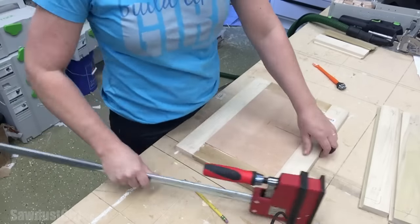I went ahead and started with 80 grit, went up to 120, and ended with 220. I finished up with 220 by hand inside the panel and on the reveal, and I used my orbital sander with just a light touch and 220 grit sandpaper on the whole surface, just to get a really baby's-bottom-smooth drawer front.